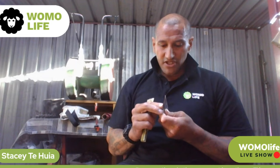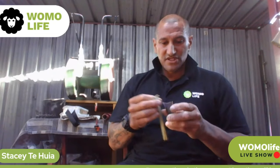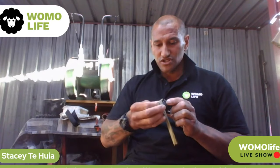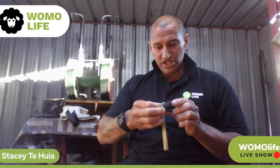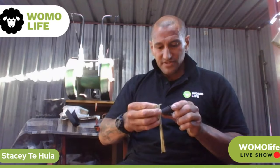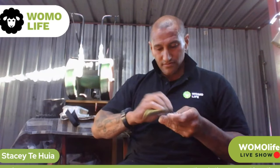Now we're going to do the tip. When you've run it from the back, the highest point is at the tip. So the point poking out the furthest is the tip. Now we're going to roll that paper over the top — you don't have to do this much; I'm only going to give it three strokes per tooth. Make sure that the paper's not touching any other teeth as it's working on that one. Sometimes you might have a comb that grinds out on one side and you've got two teeth that are ground out — this is what you can do with it.